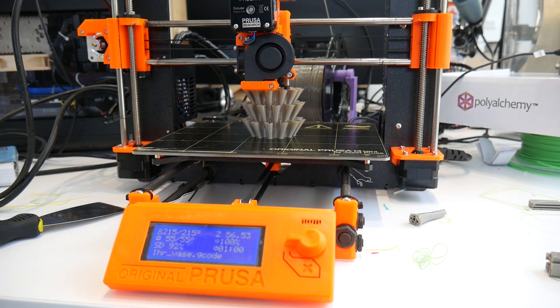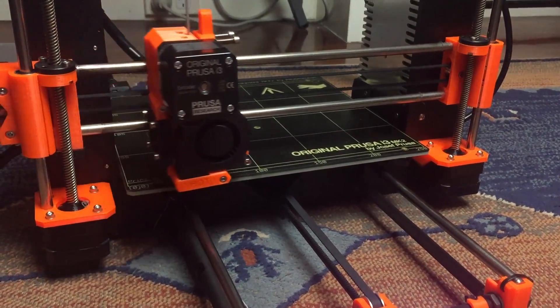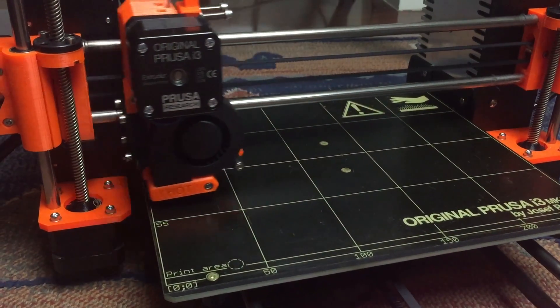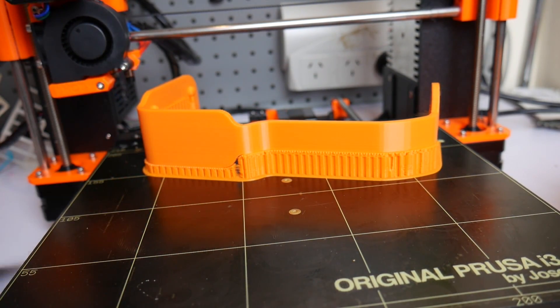So to recap: what we have so far is a good quality i3, but nothing too different to a well-built Chinese clone. Well, this is where the comparisons kind of end, as the genuine Prusa i3 MK2 has automatic everything. Before your first print, you can run a calibrate XYZ function to automatically diagnose and correct skewed axes, which honestly is just pure black magic. It also features mesh bed leveling, done using the induction probe and specially designed calibration points integrated into the heat bed PCB, which is super cool. The fine Z adjust is amazing for getting your first layer dialed in, and so long as you treat the machine with a bit of respect, it's pretty much a one-time thing. The only downside is you may be limited on print surfaces — conductive plates such as the PrintInZ plate or Buildtak's magnetic flex plate will likely have issues. Luckily the PEI sheet does a great job sticking down parts, although they did tend to stick down a bit too well and not self-release, so occasionally they need a significant tap to pop free.